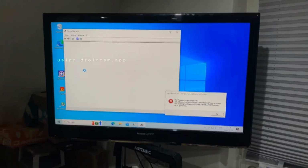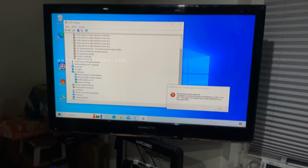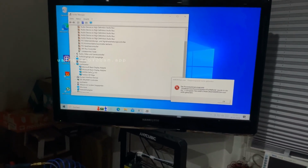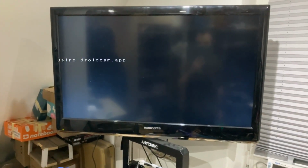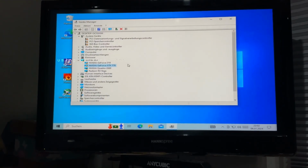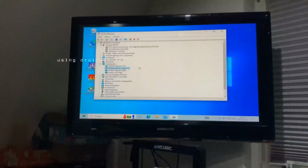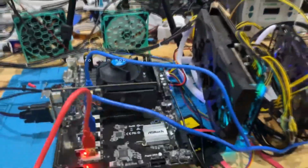And now let's go into our device manager, and let's see. We have 2 graphics cards already detected in 2 more display adapters. So we have the Vega and the GT310. And now I'm going to wait. As you can see, there's some drivers probably installing for some of our video adapters. And right now, all 4 graphics cards are detected. Don't know why there is still an error, especially on the GT310, because we are displaying from that graphics card right now. But all 4 are recognized, and I think this board works the way it should be.